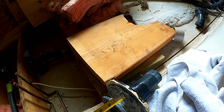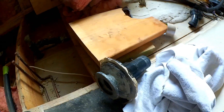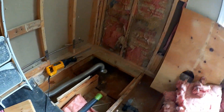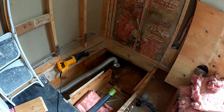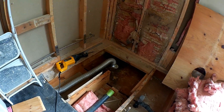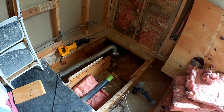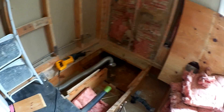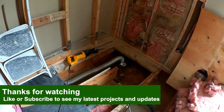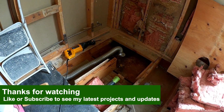With a quarter inch for the tile, they only had an inch of mortar — I'll have an inch to an inch and a quarter, which is plenty of drop and plenty of mortar underneath to be strong. I'll put my waterproofing on top of that. So that's my plan to develop this — I'm going to go ahead and work through it and show you what I come up with as I build it out.